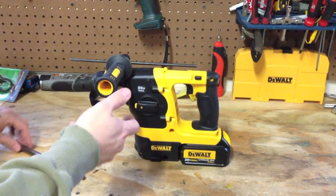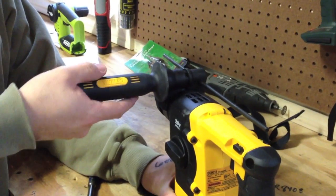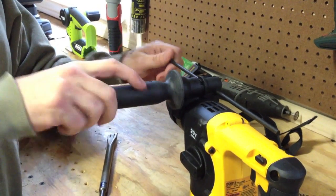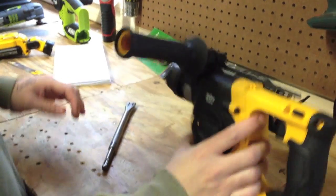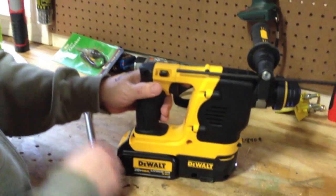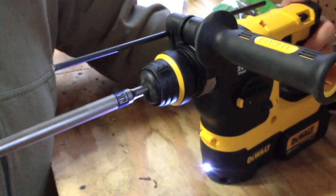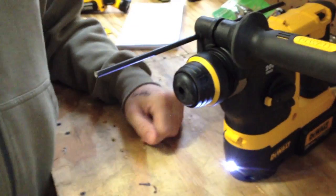There's a new 360-degree rotating handle, which works in a couple of ways. When you loosen it up, it also loosens up your depth stop — so that's cool — then just tighten it to where you want it and the depth stop is tight. On the front of the tool there's an LED light, and forward and reverse right here. The SDS bits are super easy to put in — it's in, that's it. To release, you just push the chuck and pull, comes right out.